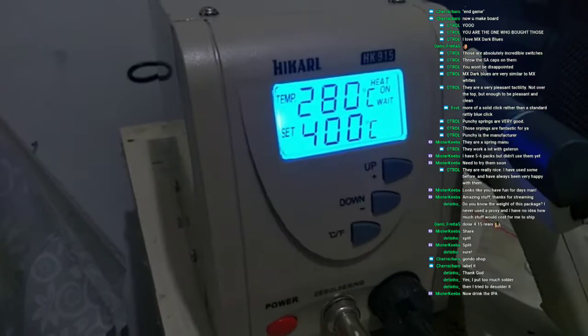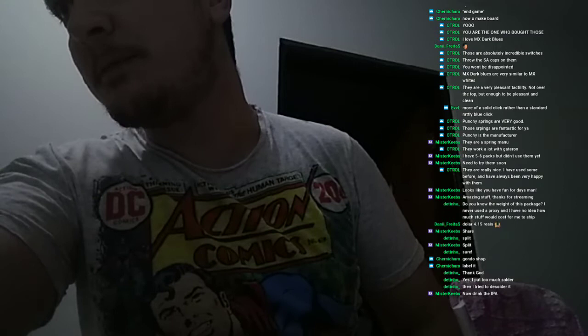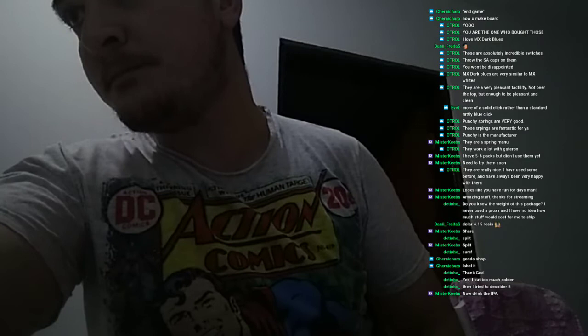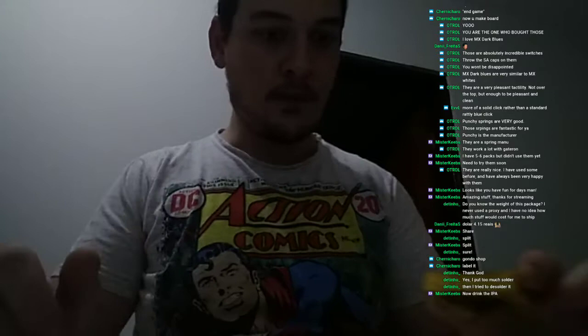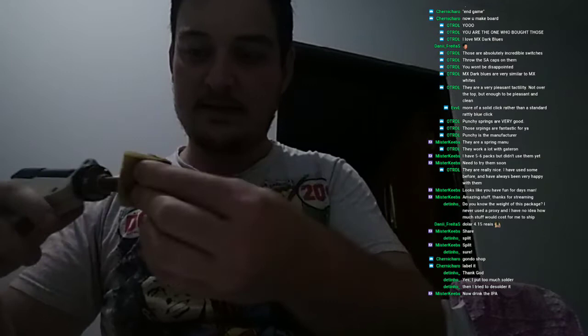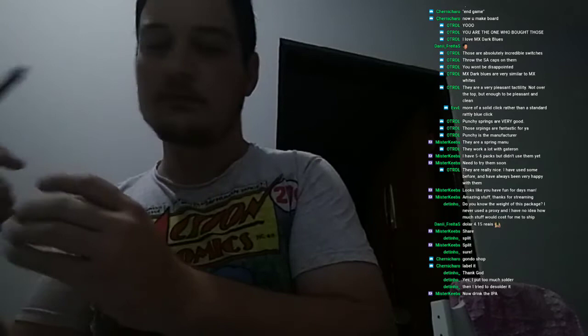We're waiting for the soldering machine to hit 400 degrees. Four hundred is probably too much. Let's use 380. Seven is good. Okay. Let's clean the tip. Awesome. Okay. So let's do this.